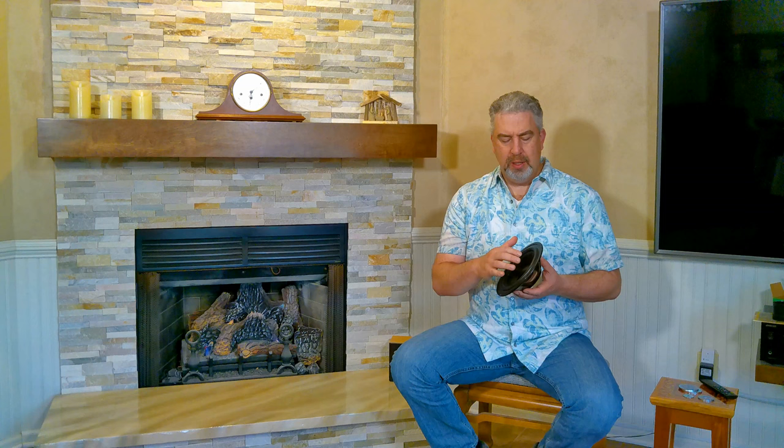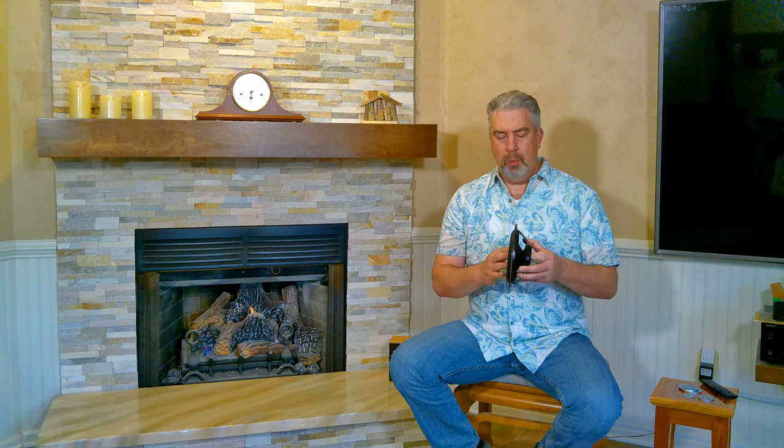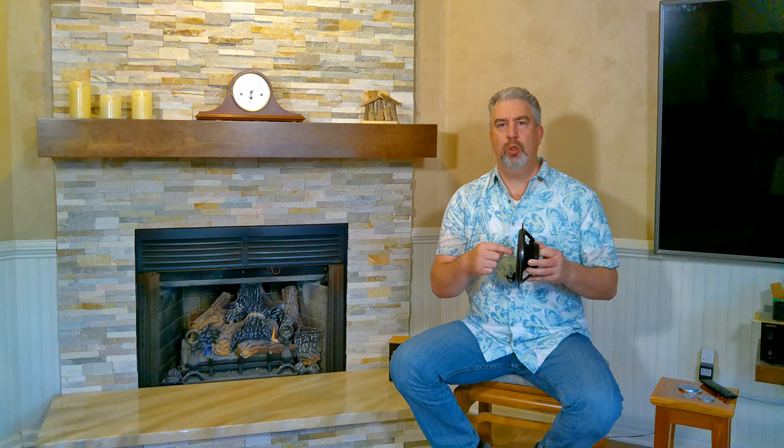So this is what I think happened. This is what I think is causing the cabinet to rock. What I think is happening is each passive radiator is designed and constructed to a tolerance. And I think one of the passive radiators, they were both close to bottoming out, but I think one of them, this one, was made to a slightly different tolerance, so that when it maxed out, maybe because of the glue joints or maybe because of the slight differences in the spider surround, this one was reaching its limit a little bit sooner than the other passive radiator.